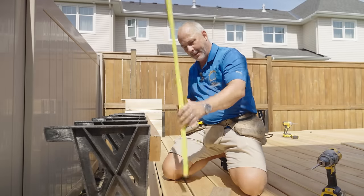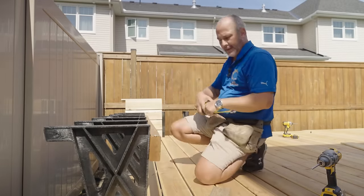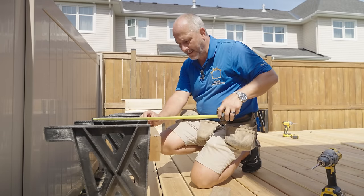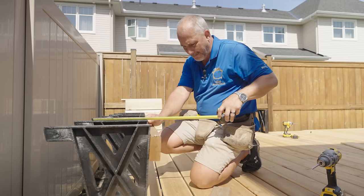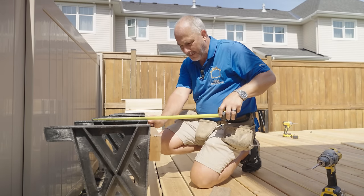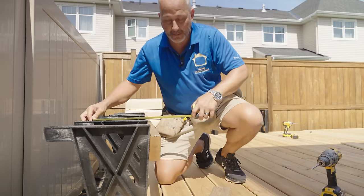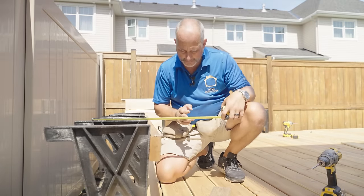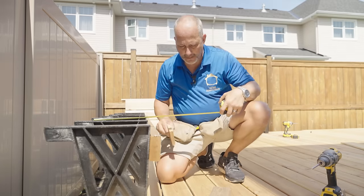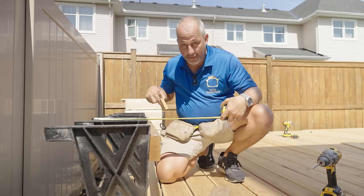Now, the height of this, it's easier to measure off then, 13¾. Okay, and we wanted an 18 bench. That's 10¼, that's 7¾. But I want it on the finish. I'm gonna go 17 so that the cushions are over top of the finished wood. I really gotta consider that. My cushion comes to 18, so I don't want my framing to be more than 17. So then my cedar facade will be just shy of 18 and it'll allow for a little variance.